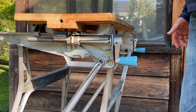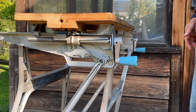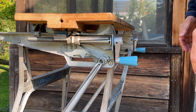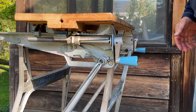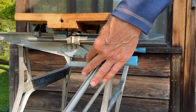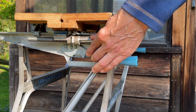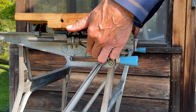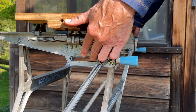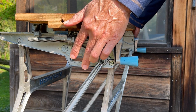To allow the Workmate to fold and unfold, the upper ends of the 2 side struts slide in slots in the upper frame side pieces. There is a finger-operated latch on each side that does double duty to lock the Workmate in the fully open position and to lock it in the folded position. To release the latch, you lift up on it with a finger.